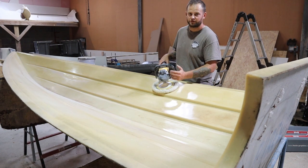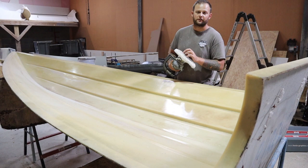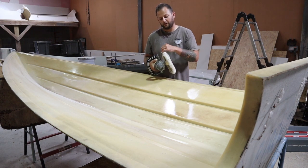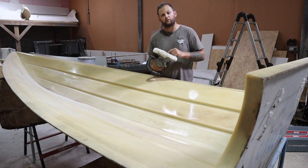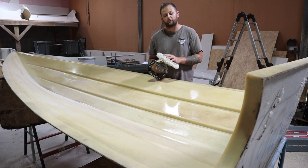And then just try and change these over. These lamb wool pads, some of them have red stitching or a different kind of stitching inside. Once that begins to show on the pad, you really need to start looking at changing it, because although it starts off very nice and fluffy, because of the high temperatures that these can get to, they tend to tear away the wool itself and then wear down over time. And then it's not doing its job properly.